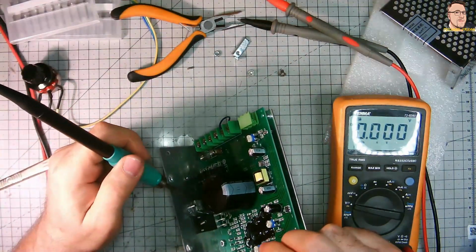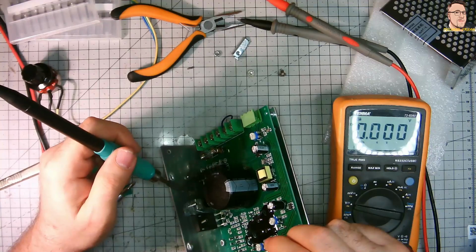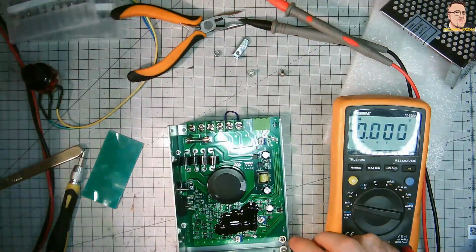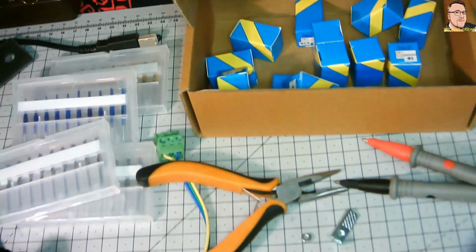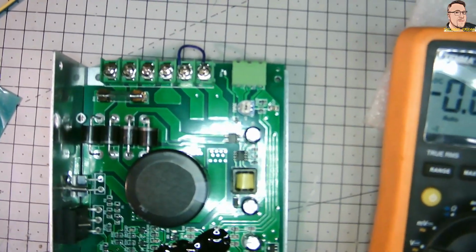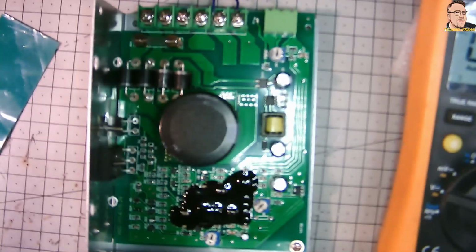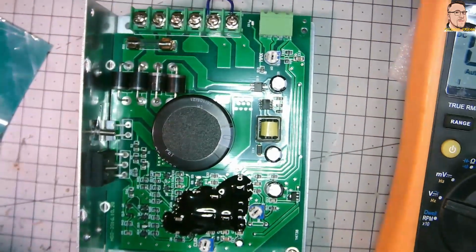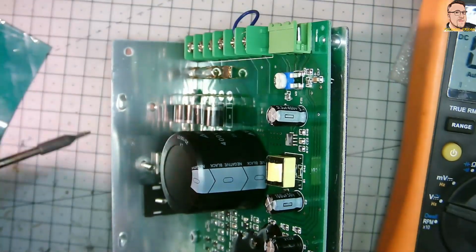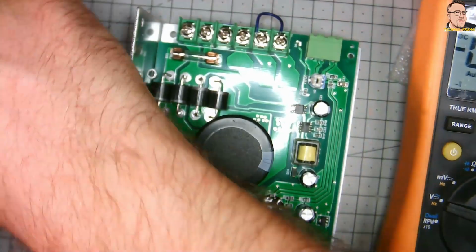And let's check what happens if I use the soldering iron to touch. And it's bad. Unfortunately, when I touch this material, I was afraid it's just like that. It's not mica, because the old style, I think, is not really in use now. It's like mica insulation pads under transistors, but it's really old technology. It also requires thermal paste. It's no thermal paste, it's normal plastic. A sheet of plastic, like foil, which, as you can see, is melting straight away.